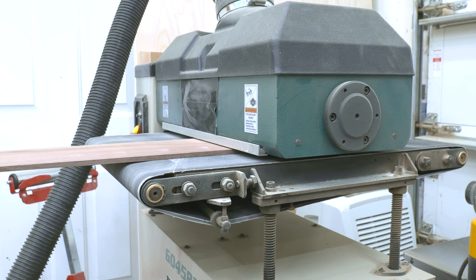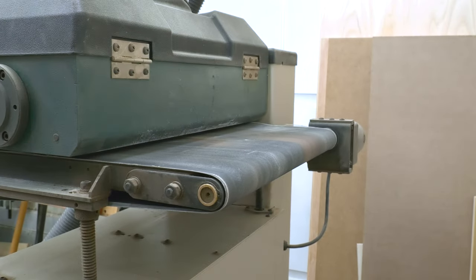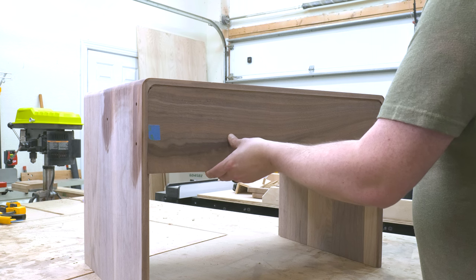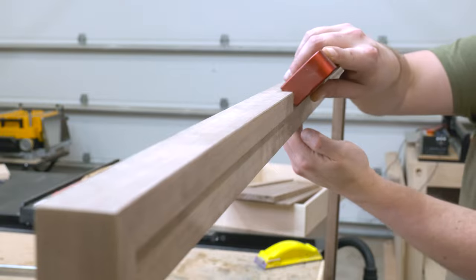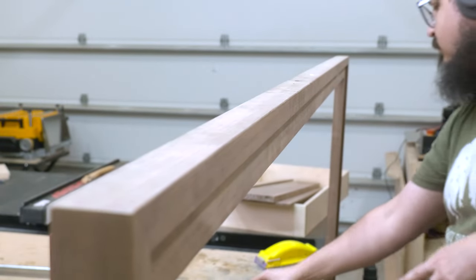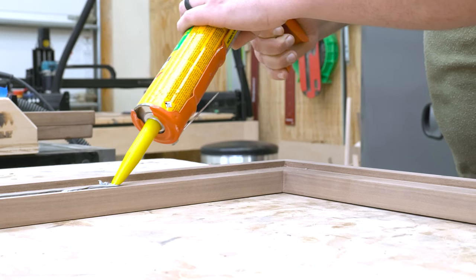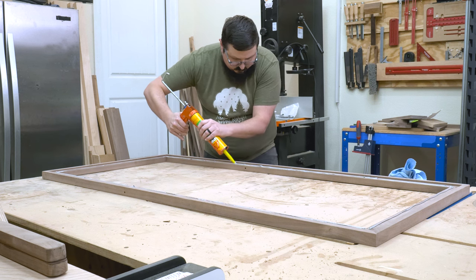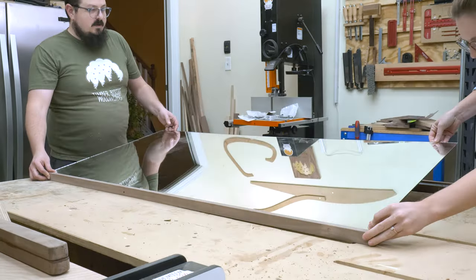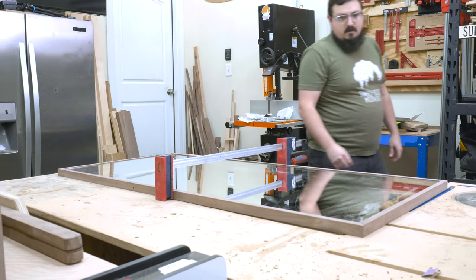My rear panel was a little thick so I just ran it through the drum sander to thin it out until it sat flush in the rabbet. Next I rounded over the outside edge of the frame so that when anyone grabs it to adjust the tilt there aren't super sharp edges. Then it was finally time to drop in the mirror — to attach the mirror to the frame I'm using construction adhesive. Once I had a small bead laid around the perimeter, with the help of my wife I could place in the mirror. I did have the tiniest of bows at the center of the mirror so I went ahead and added a clamp to squeeze it out.